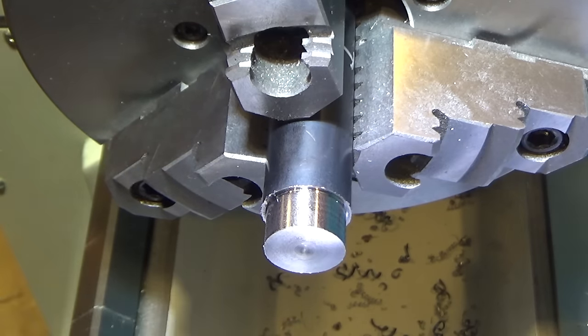than the ways. So, I like to constantly clean chips off the ways while I'm working, and it may seem a little crazy, but the truth of the matter is that they're really hard material and they could scratch your way, especially if they get stuck underneath the wiper and on the ways, between the wiper and the ways itself. So anyways, that's just my thought.